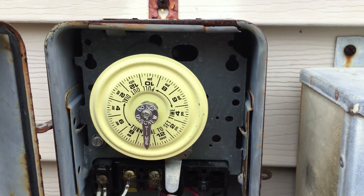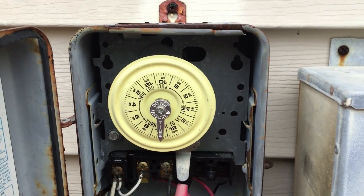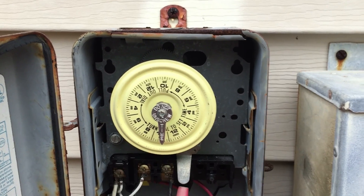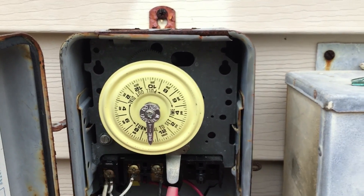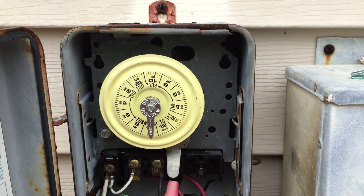You should be able to physically see those turning. If not, you could check your breaker box to see if the breaker flipped, and if the pool breaker box is on, go to your garage and check that breaker box to see if the breaker for the pool had flipped. If not, it's an issue with your timer motor.